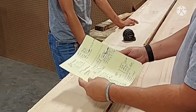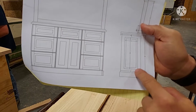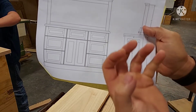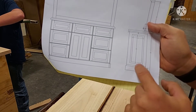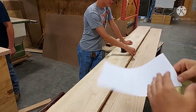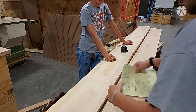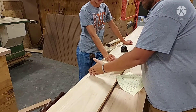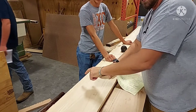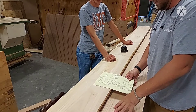So he's basically going to have a frame, and his frame actually is going to go all the way down to the bottom of his base, so that whole heavy thing is supported all the way down. This piece actually needs to be seven inches. We don't really like a seven-inch piece, so instead of having one piece that's going to end up being seven inches, he's going to cut it and then split it in half and flip it so the end grain alternates — less likely to cup or warp. That's what we do with pretty much anything over six inches.